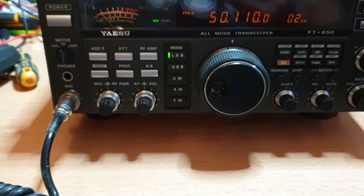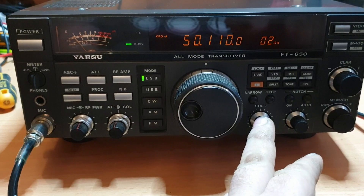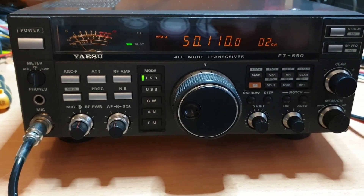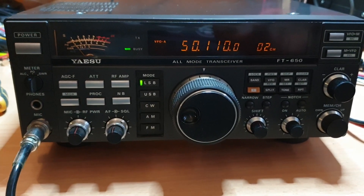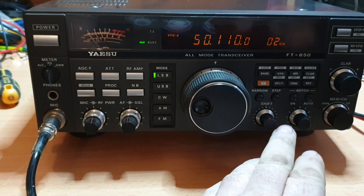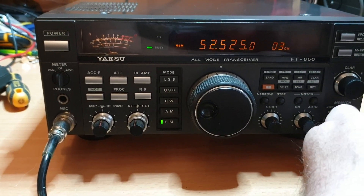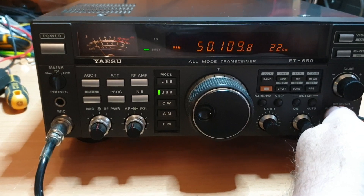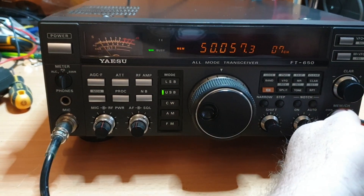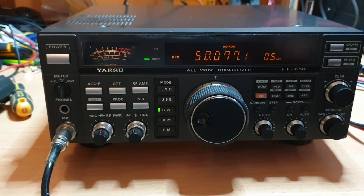I could go through a lot of the features of this. There's lots of things here — the notch filter, they had quite an advanced notch on them. The IF shift is actually quite handy — it's a nice little function when you've got a signal that's in the noise. You've got about — I think there were 30 memories, or it might be more. Looking here, there's memory 22, so it definitely goes up to 22. You can basically set your memories at whatever frequency you want. I just can't remember whether these were similar to the 990s with 90-odd memories or not. I won't sit here and program it while you're watching — it'll be here for hours.